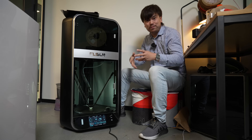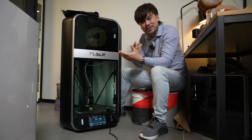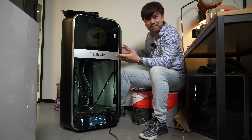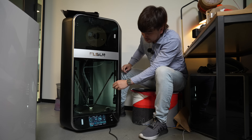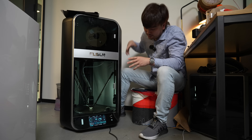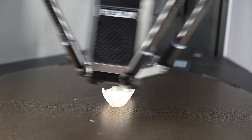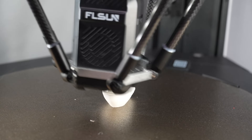We already talked about the turbo-style CPAP fan — it's embedded in the machine so I can't pull it out, but if you Google CPAP fan you'll see what they look like. It's got a high-speed turbine blade that spins up just like a car's turbo — kind of like a vacuum cleaner — forcing air through this tubing right there. That allows it to push a ton of air down to the hot end and cool parts extremely quickly. The advantage is a really powerful fan that you're not carrying on the tool head, which reduces weight and lets them hit those high accelerations.